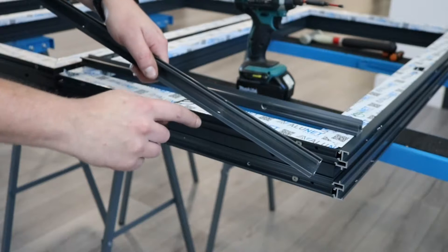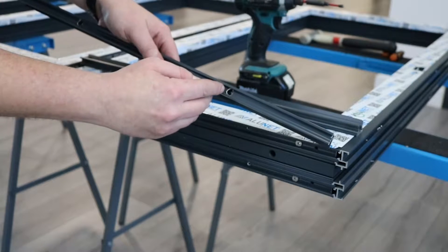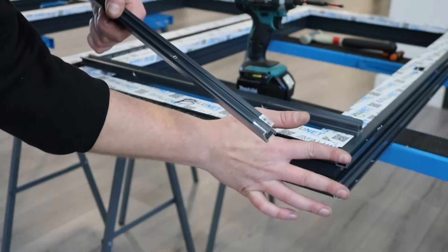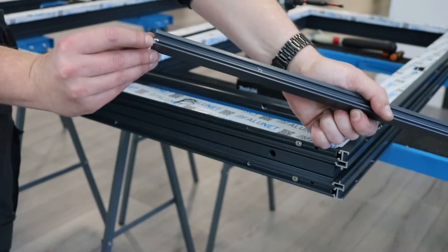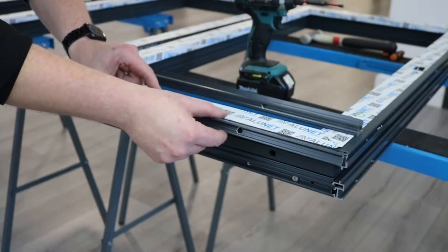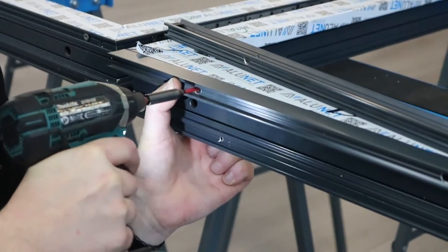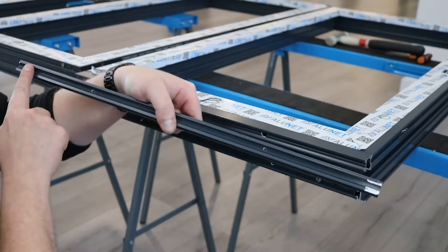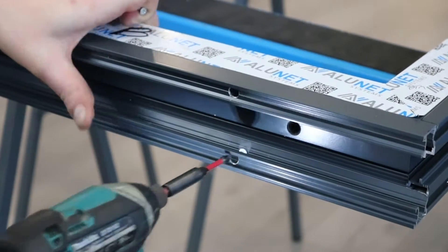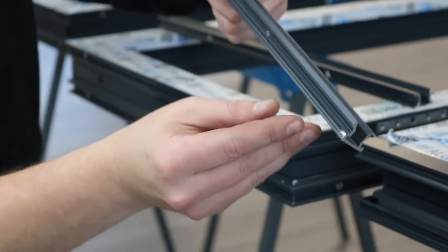For bottom sash extensions, these can be screwed on at an angle through the bottom. The easiest method is to put a 9mm hole through the top with a clearance hole through the bottom. We also need to take the tops off on the punch tool, and each corner needs nipping off so it hooks into the sash properly. Put these on, hook into place and screw through, repeating the same for the bottom. The other sash extensions just need the ends nipping off before screwing in.